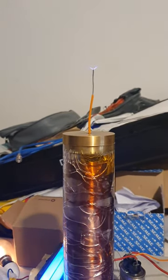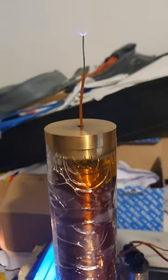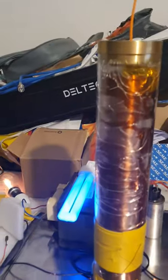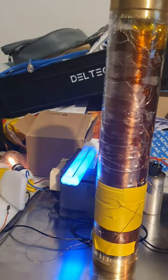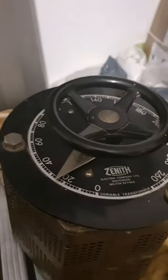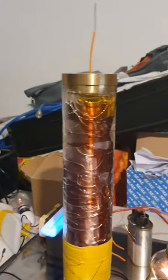Let's just see what volts we can get to to actually sustain. That's at about 40 now. The light is still clearly glowing. Just needed to wake it up a little bit — as soon as it swamps the oscillation. Let's turn it down some more, and that's when it stops. We're about there on the variac. So I think there's still a bit more tuning to do, but stay tuned for more.